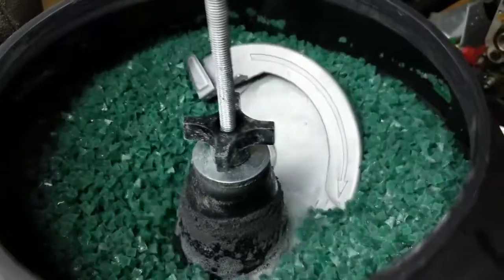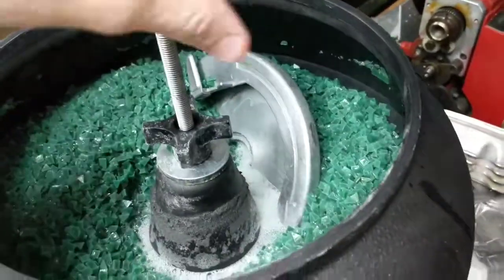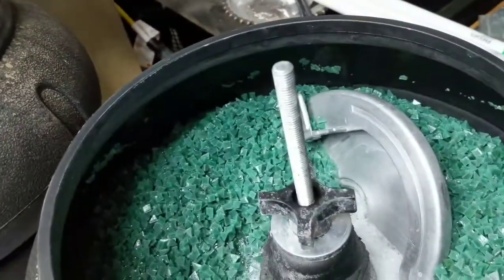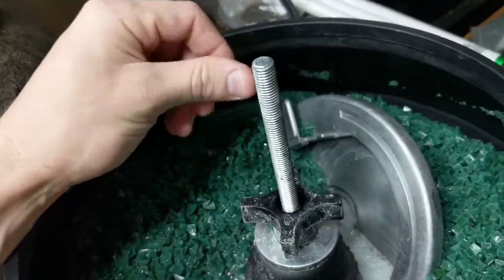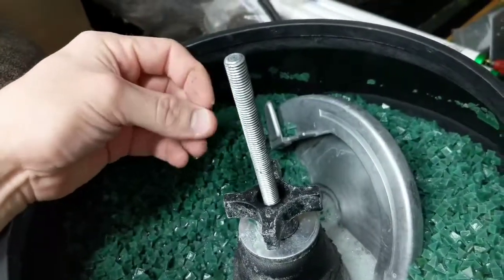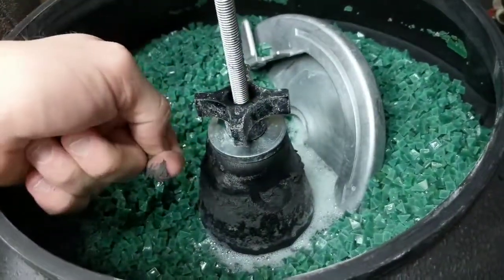The vibration makes the pyramids flow. The part just will slowly revolve and flip end over end, just kind of semi-random from the vibration. And the pyramids have some kind of grit in them, so they're hard as nails. I mean, they're plastic, but they're hard as nails. We got a little bit of warm water, only warm from the vibration actually, and a little bit of Simple Green floating in there with the shmoo. This is probably aluminum powder.